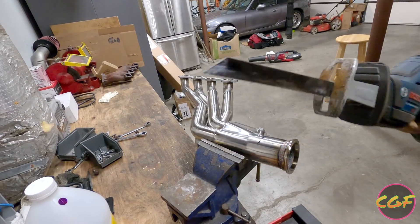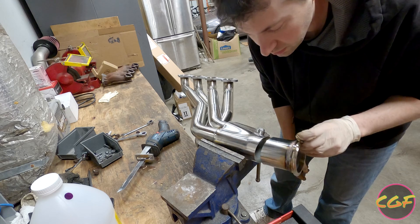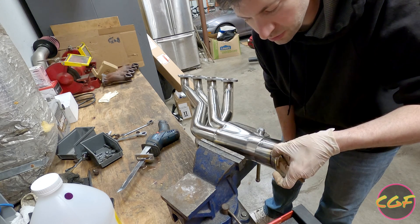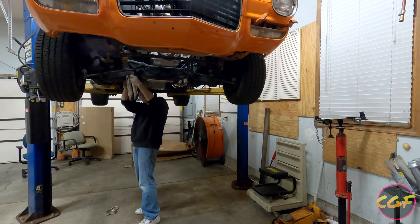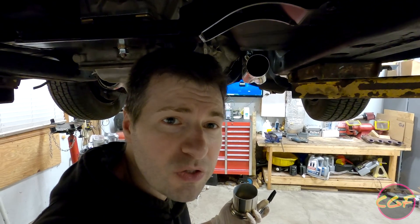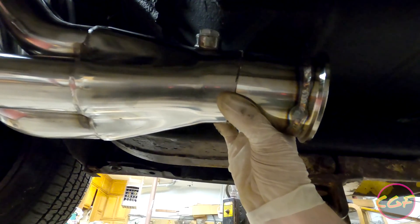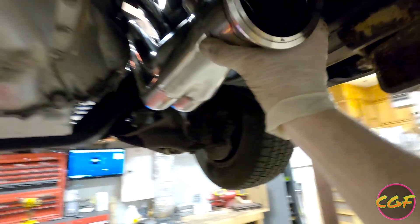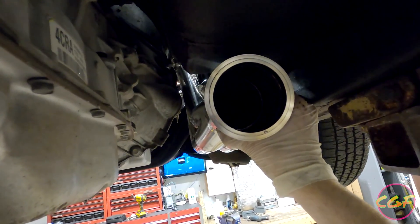Time to do some cutting. And it's cut. You can see - probably something like that. First step is to get the header bolted back up so we start seeing what angle we need here. There it is, cut off. Pretty sure you'd have this problem whether you put a V-band on here or not. So I retract what I said earlier - you will have to be able to weld at least a little bit to get these to fit, but not much. It's probably something you can contract out if you don't have a welder. You can see that gives a pretty decent amount of clearance above - it's not a huge detour, and now we can just go weld it on the bench on the TIG welder.